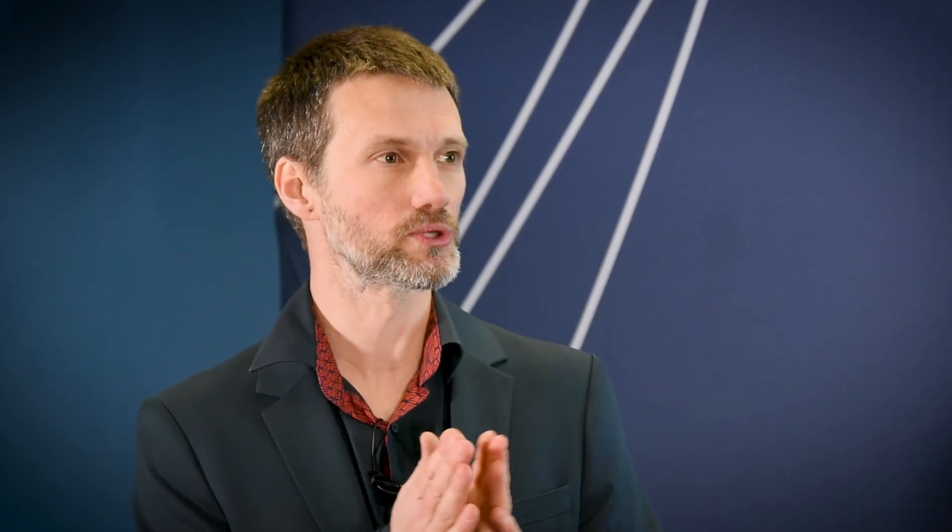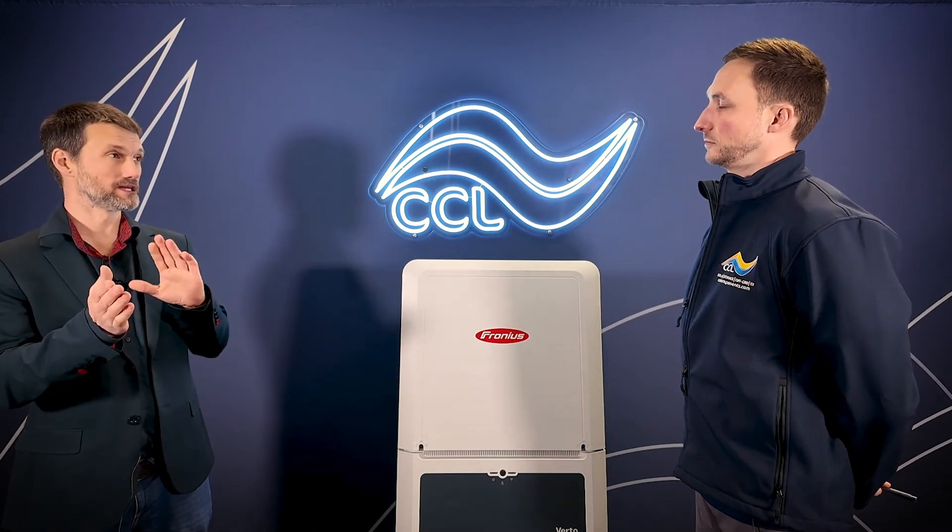So what would be the main differences between the Eco and the Virto? The Eco only has one MPPT tracker and it's got no DC-to-DC booster. So when you're designing and installing with the Eco, you have to be very careful of the string lengths — you might find that you can only do maybe 16 or 17 panels within the voltage window the inverter will function in. Whereas with the Virto, you've got four MPPT trackers and four DC-to-DC boosters, so you can have that much wider input range. The Eco is still a very cost-optimised solution, so if you're able to design the array to match the inverter, then it's still a good choice. But for flexibility, the Virto is the one to go for.